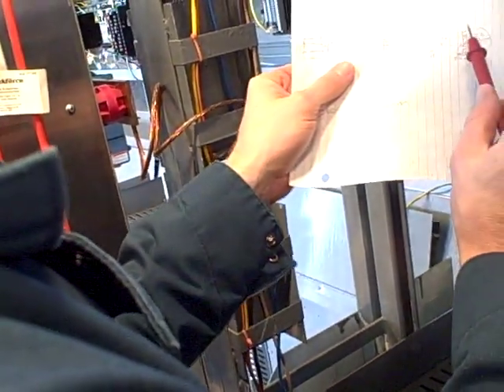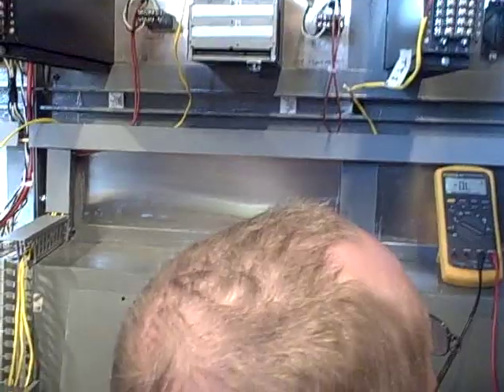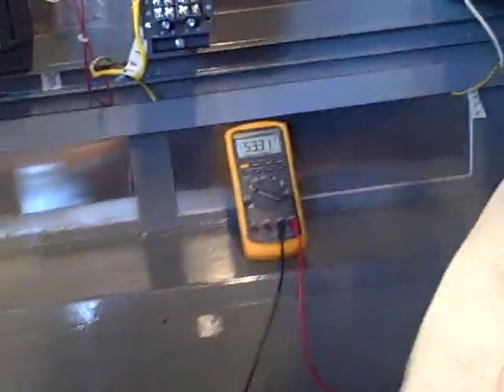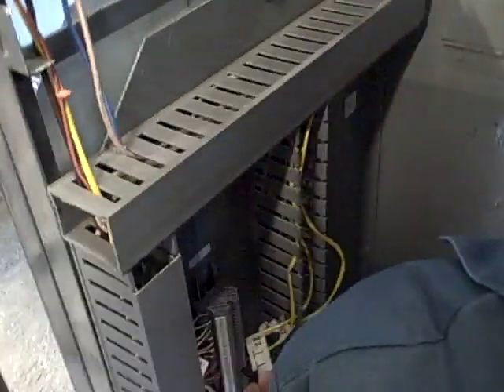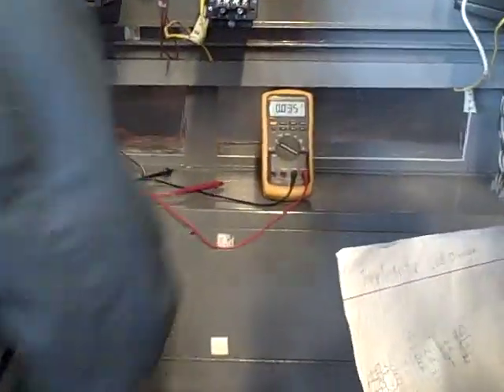What I'm going to do is measure across wiring from B5 to 17. Being ideally common, we should read how much voltage? Zero. B5 to 17 — I read zero. What's my next point I should check? You should check your other wires — that would be A4 to 18. Negative 53 volts. What does that tell you? They're not common. What kind of fault are we dealing with? An open. Exactly.